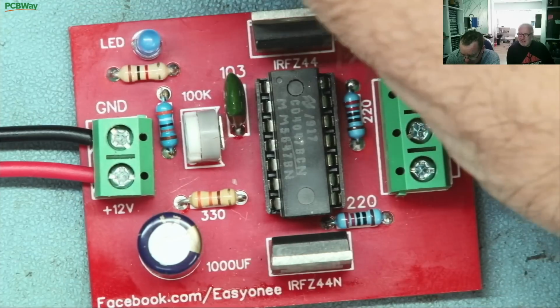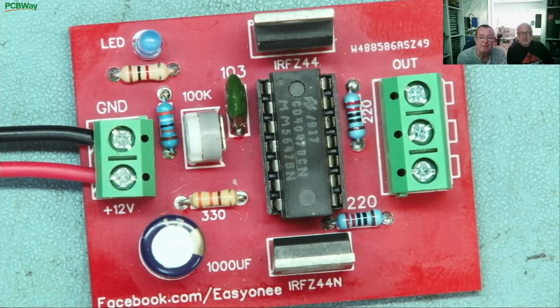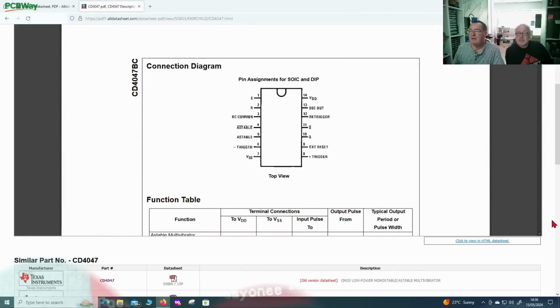Without any more messing around, shall we have a quick look at the pin out of this thing first, so you guys will know what we're talking about. One moment. Yeah, I found it here, guys. This is the data sheet. The problem I found was the oscillator out on pin 13. The chip was oscillating, but Q and not Q is supposed to be anti-phase to each other at half the frequency of oscillator out. And there was no frequency on those, so there was none.